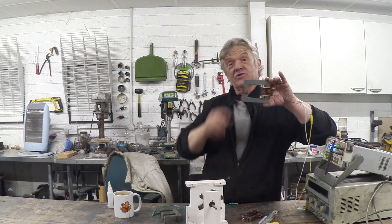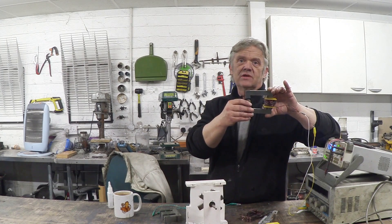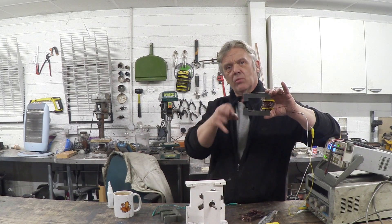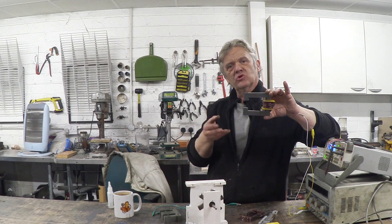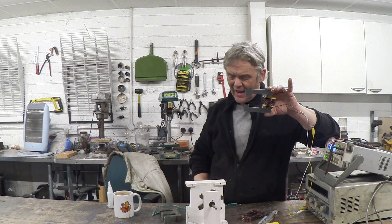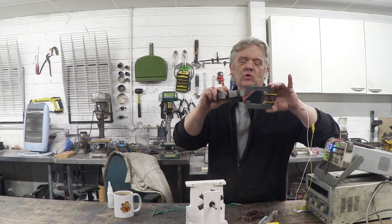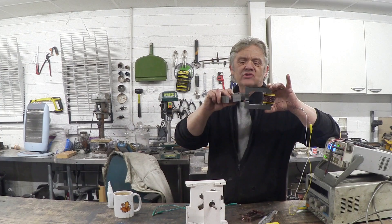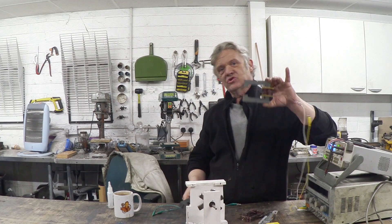This gap represents a great deal of reluctance. The field is concentrated there but it doesn't like to be. What it wants to do really is go to the lowest energy state possible and that would be to reduce the reluctance of that gap. Now if there happens to be a lump of steel near to that gap, what's going to happen is it's going to get sucked into the gap and that will lower the reluctance.